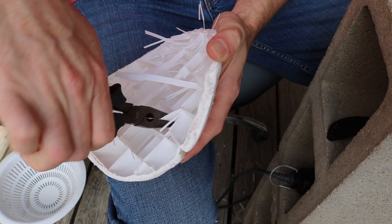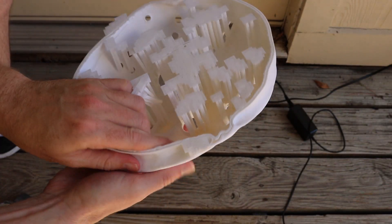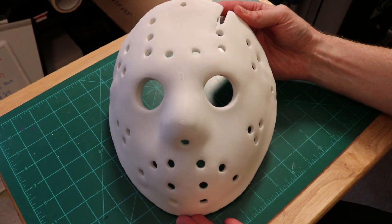I didn't record the process of printing all of these, because after the first one I realized there's going to be a lot of trial and error. The first one I printed complete, thinking I'd just drill out the holes, but it was such a pain to remove the support material — that had nothing to do with the printer, that was about how good PLA filament is. I underestimated it completely, so that one was on me. Then I tried printing only the outer edge, and this one's bigger because I didn't know how much space I had. I realized I actually had more room to work with because this printer is huge. But again, I kind of messed up — I had printed it hollow with a shell, and cutting it off left the back side very rough and beat up.